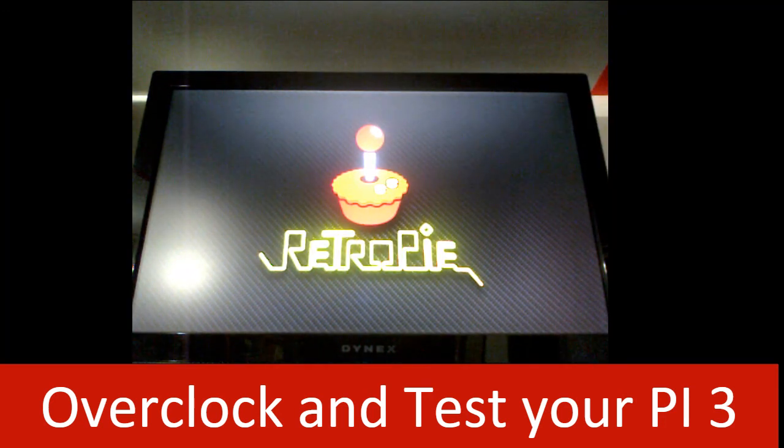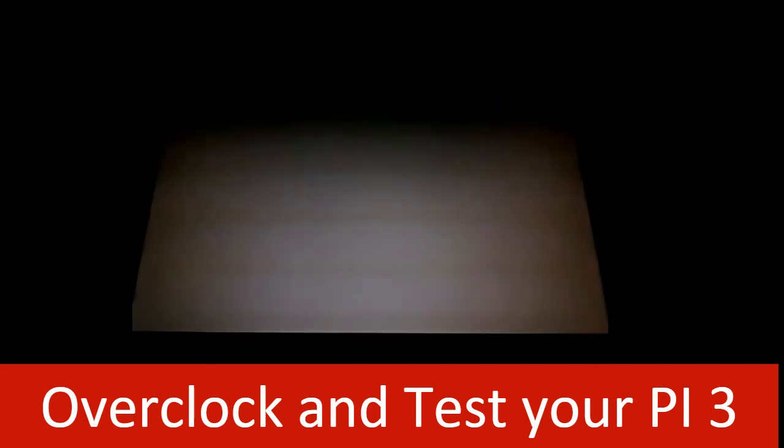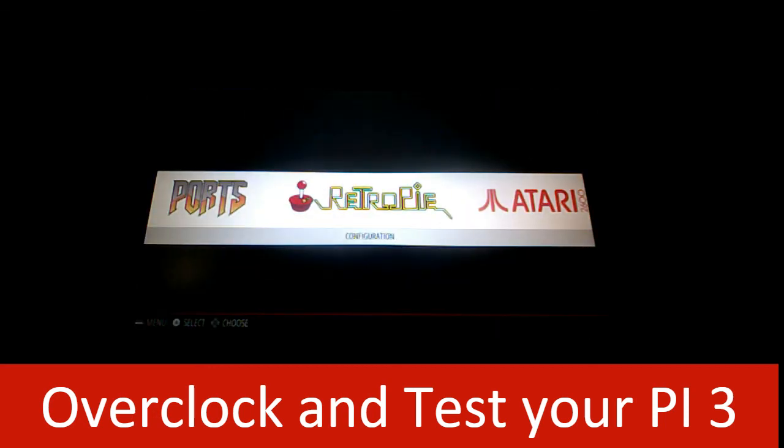Alright, so I'm back. I tried overclocking my CPU even more on the Pi. I tried to go 1600 first, and my Raspberry Pi booted up, but it would default to 600 megahertz. So then I tried going down to 1550, and that did the same thing. It defaulted to 600 megahertz. So I guess 1500 is the max. I didn't know that, so I figured I would try. But just in case anybody was curious, 1500 megahertz seems to be the max on the Raspberry Pi 3.